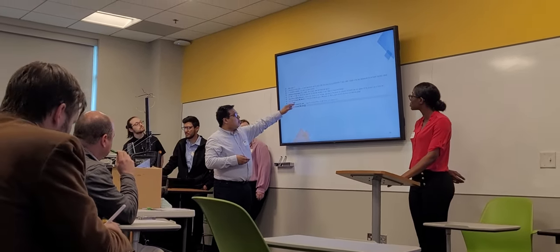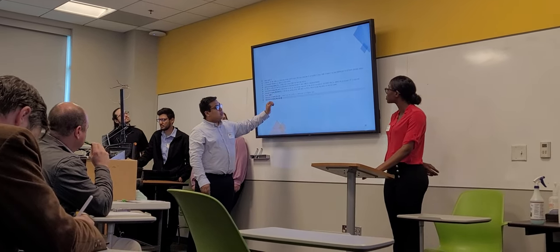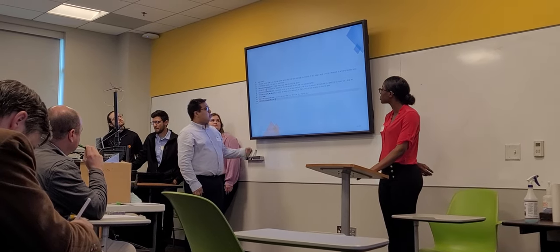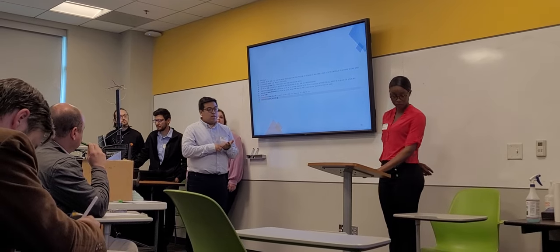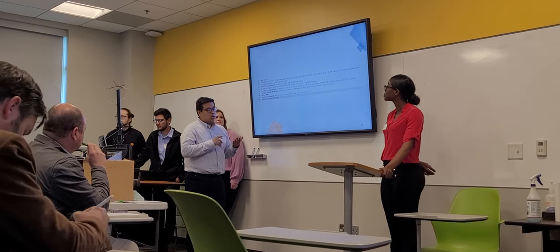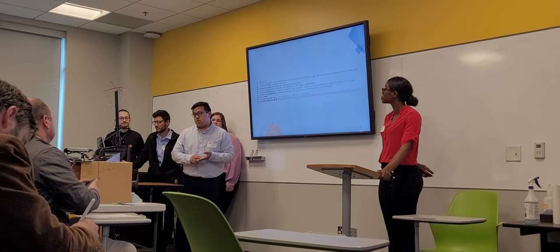And then the output write is going to activate the pulse width modulation pin, and then it's going to send another wave to it of the value that we selected. We selected the values to be between 60 and 160, with intervals of 20. The minimum is 0, which is off, and 255 is the maximum, which is always on.